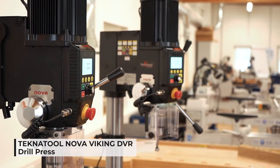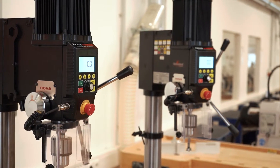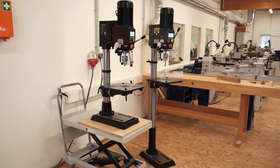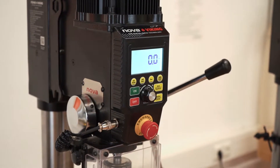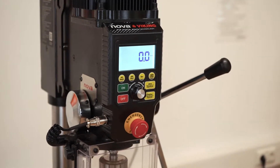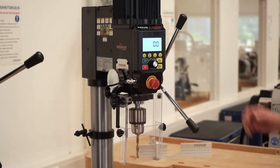As you can see, for a benchtop or mid-range floor drill press, this is a well-constructed heavy-duty machine for its class. With a dimension of 20 centimeters from column to quill center and 11 centimeters of quill travel designed specifically with turners that drill pen blanks in mind, the quill travel is achieved with just one and a quarter revolutions of the handle. The capacity of this machine is capable of a wide variety of jobs in any shop.